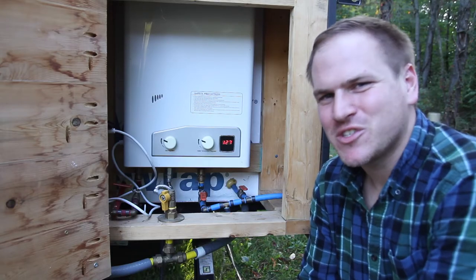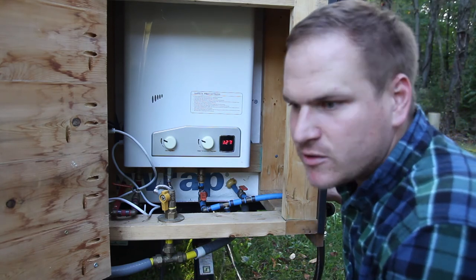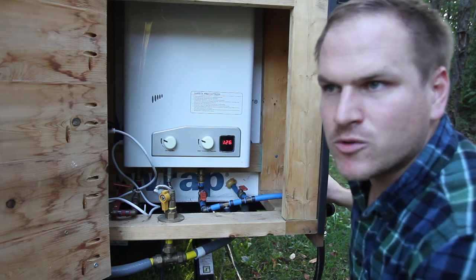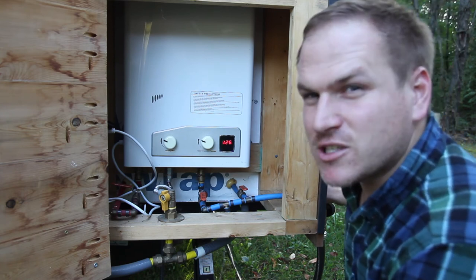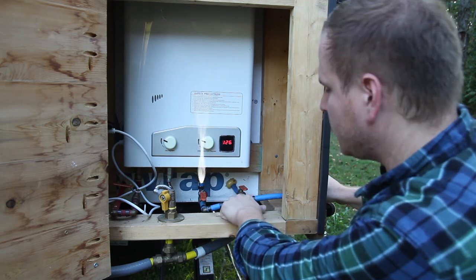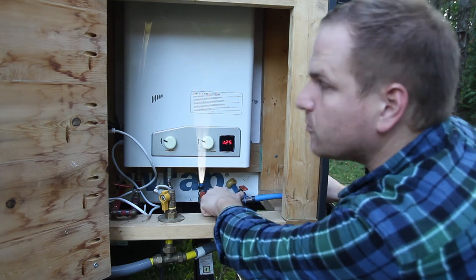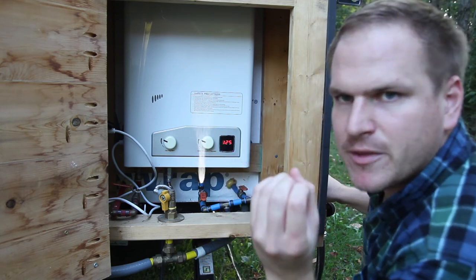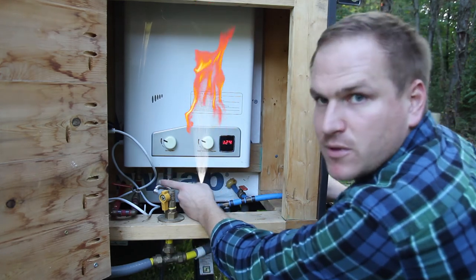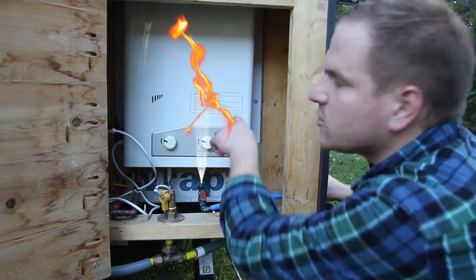This is my special edition on tiny house water heaters. Cold water comes in from your source — right now it's a garden hose because we're about 200 feet away, but you should use an RV water hose, which is a special type that doesn't allow the leaching of chemicals like a garden hose does. Basically this is a manifold — it takes the water and controls when it can go into the house and when it can go into the water heater. The water runs through the manifold up into the water heater, where this yellow CSST tubing supplies propane that ignites and warms the cold water as it runs through.